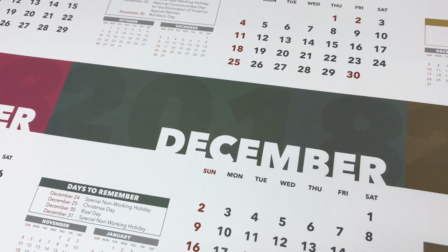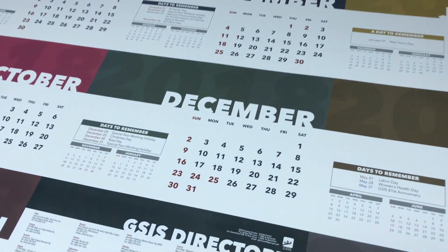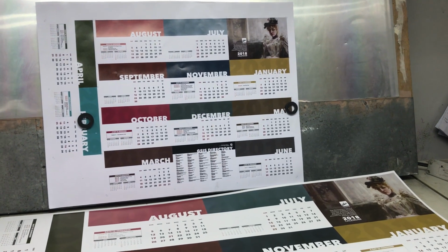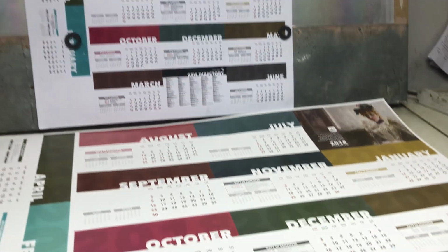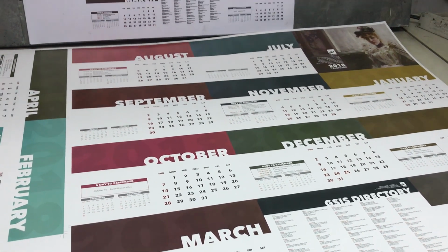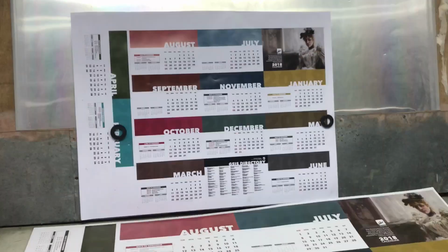The center of the 2018 is a little bit more yellowish than what it should be. So on the next run, that is going to be adjusted. And our basis for judging the colors is this digital print right here, the smaller one that is propped up by magnets, and we're comparing them manually to the printouts at the bottom that actually are coming from the machine.